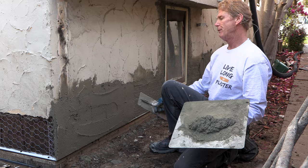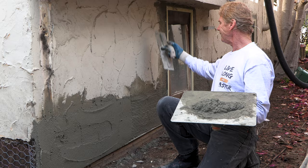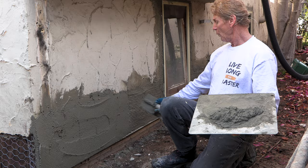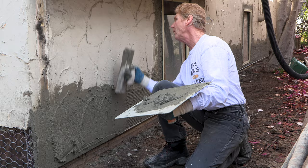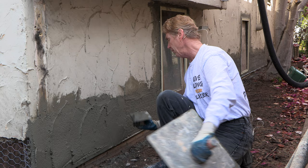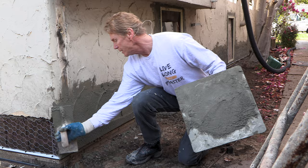Now look at these — they're more vertical, they kind of go upward, like from seven o'clock to one o'clock. It's got a lot going on but it's kind of easy to match. You just take what you already have here and take a little bit of excess mud. I'm going to try to follow that particular pattern — going vertical. You add more if you need it; you'll know because it won't achieve those little slobbers. Like I did on the other side, I'm waiting for that to set because the transition can't be this sandy — that's another half hour.